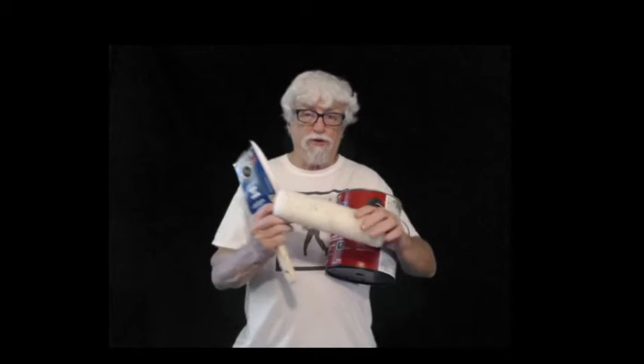I've got some paint from Lowe's that's made by Sherwin-Williams and I also got a new roller sleeve. Make sure you get one that's the right nap length because the longer the nap, the more texture you're going to have on your walls. Also make sure you pick up a new paintbrush so when you're cutting in you get a good loaded-up paintbrush without any clumps, so you can just get that paint on the wall.